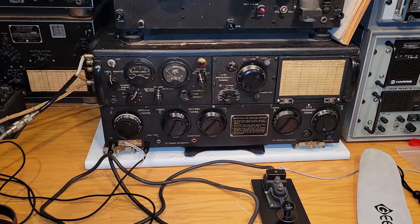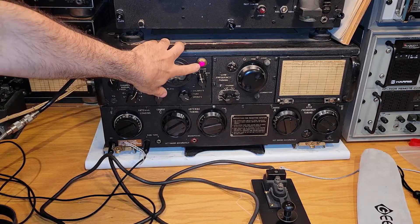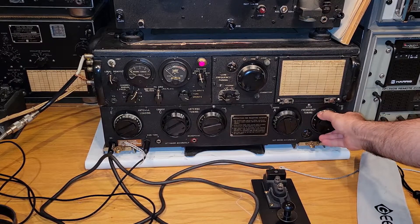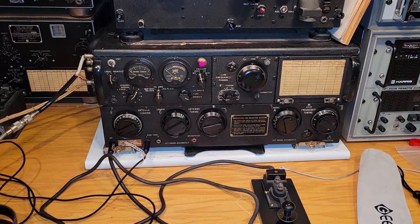I'm going to put it on channel two and see what happens. When it's done tuning, the red light comes on telling you that it's ready to operate and ready to be keyed. What happens is you saw them all turn in one direction — that's to get an index, set them to a known position — and then they fast forward in the other direction to get to the desired spot that was programmed. This one turns a lot because it's actually a 20-turn dial with a little turns counter, so you get one turn here and 20 turns there.